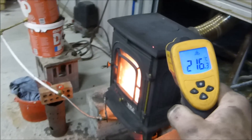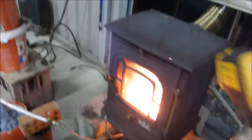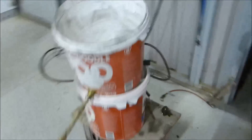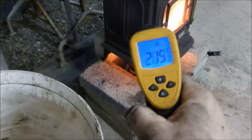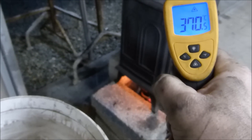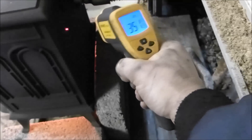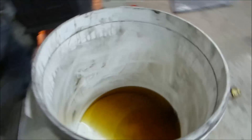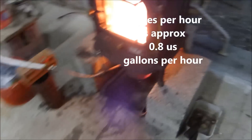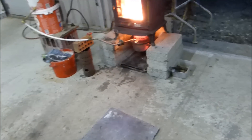308. I have some baffles inside protecting the outer wall of the stove. If I took them out this would be a lot hotter. Hottest part of the stove seems to be about 380 or so. At the moment it's burning about 3 litres an hour. I don't know what that is in American — probably heading up on a gallon an hour. But a savage amount of heat out of it.